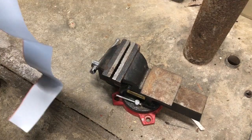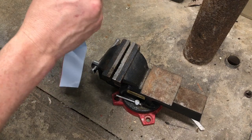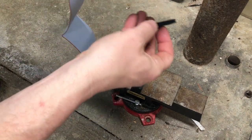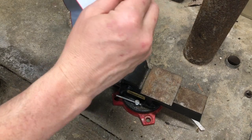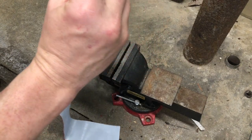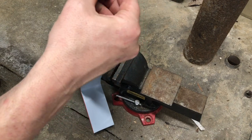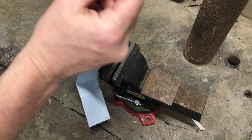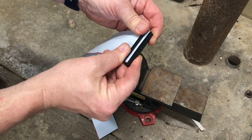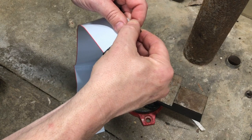Okay, the one thing that will have to be made by hand is the cable that goes from the controller board to the back of the case of the hard drive so it can be connected to a computer. That, of course, was long gone. So we got a ribbon cable, we got a female ribbon end connector, and there's very few ways you can do this and get it done right. Don't open it up, don't try to press it with a pair of pliers or anything unless you like replacing them over and over. Put the ribbon in, give it a slight squeeze until, there we go, until the ribbon's a little snug.